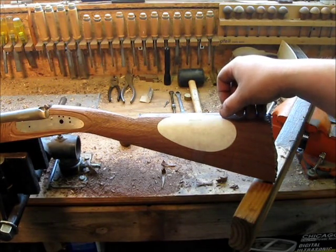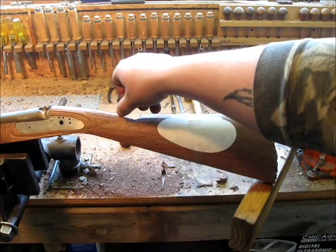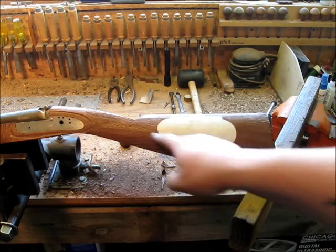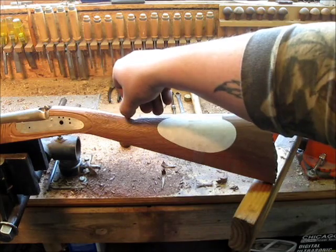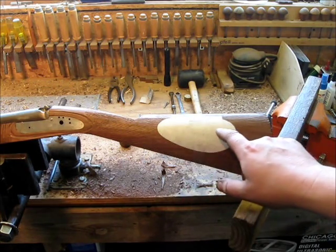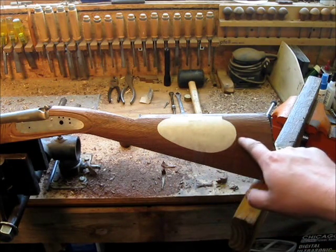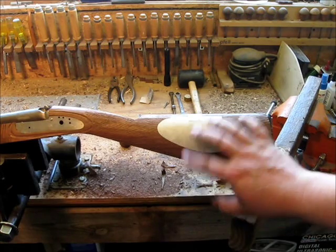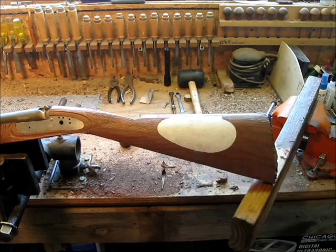The other style that's kind of common is what's called a fish hook, where it's got this same curve back here but instead of coming up into a circle, it runs straight up and kind of blends in with the wrist. It usually has a shadow line at the bottom and makes a fish hook appearance. Those are the two most common you'd see on English guns — the pancake or the fish hook. Cheek pieces can be convex or concave, either one, and that can be done to accommodate particular shooters and how they want the gun to fit. For the most part, most of them are flat across the face following the radius of the cheek piece.